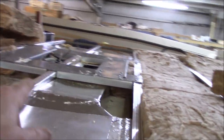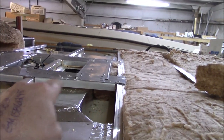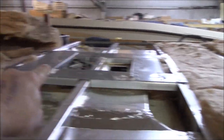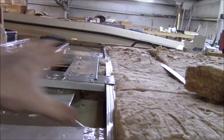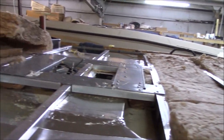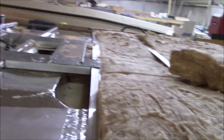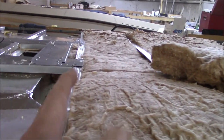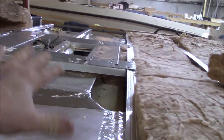What we did over here instead of making all new trusses — that's structural grade steel. You can see we glued it all together and screwed it all together. What we did differently is we spanned this whole piece — that's going to bridge all that weight all the way across. Then we also did it going this way, so now everything is all tight. We're going to put our decking — it's going to come over here and over here, one piece here, one piece up there. We may have to cut one down to 32 inches or whatever it is to fit, but I want all that strength right there.